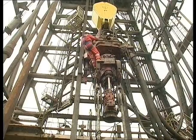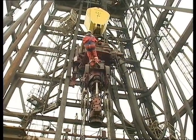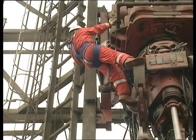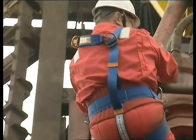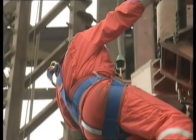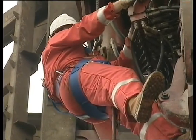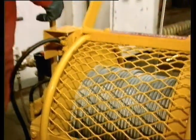The upper and lower maximum travel limits can be preset with this winch. These adjustments should be made with a test load before operations with a person begin. These adjustments must be carried out by a competent person and controlled under the permit to work system. Used correctly, these setups will restrict the movement of the rope to the specific work range required for the task, and in turn will reduce the risk to personnel. The air winch also comes with a drum guard to protect the winch operator.